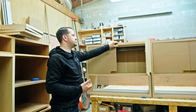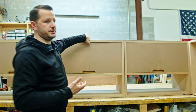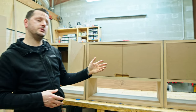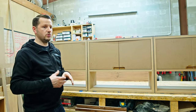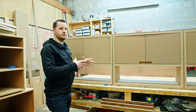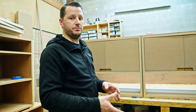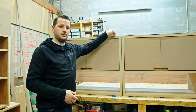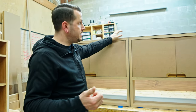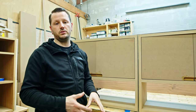We do have a few other holes along the top as well as the bottom — those are for screwing the cabinet to the steel. There's a little bit of ebb and flow to the steel and the cabinetry, so we want to make sure those are going to be nice and flat. Right now the steel case and the steel beam are left raw so we could get everything assembled and dry fit here in our shop. Once finished with all these pieces, we'll send all the metal parts out to the powder coater to have them powder coated in black to match the post in the ceiling. In fitting these cabinets to the opening, we did leave a little bit of space to account for that powder coating, as well as the finish on the actual cabinets and a little room to slide these cabinets in.